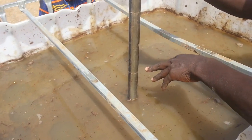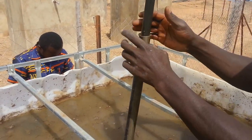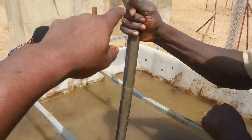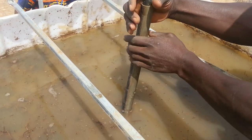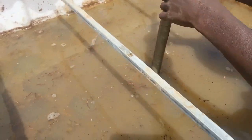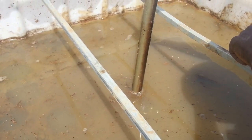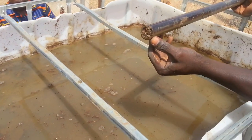Until around 25 centimeters, you pull the smaller one out and you create a vacuum at the bottom. Then you continue pushing down. This must not slide inside, of course. Then you reach the depth of 30 centimeters, and you turn to cut the soil sample exactly at 30 cm inside the soil, then you pull it slowly, slowly, slowly, and you get the sample of soil exactly at the depth you were targeting.